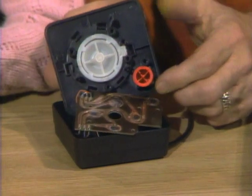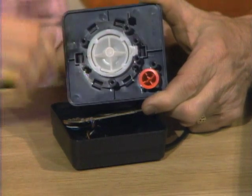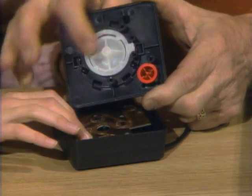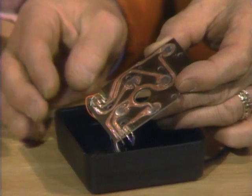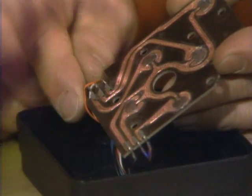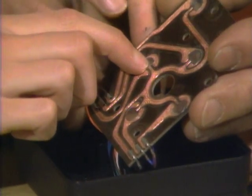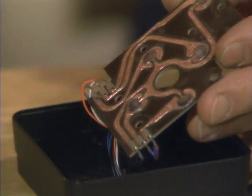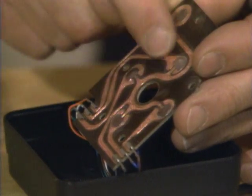A little plate — you see that plastic wheel? Yes. Move the joystick. Oh, it presses down on something on the plate. See, there are four little bumps there and it presses on them. Now let's take a look — we can pull it up like this. The current comes in down here — see how it follows along those copper traces? Then trace that one — when it gets right there, it stops. Why? Because there's a switch. So when you press it, that's what the little plastic wheel does. You can press any one of them.